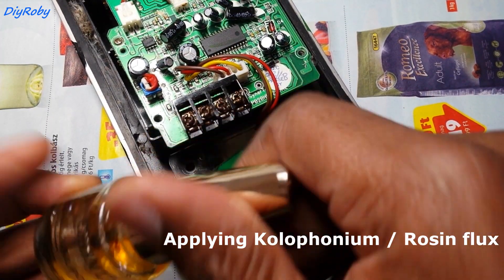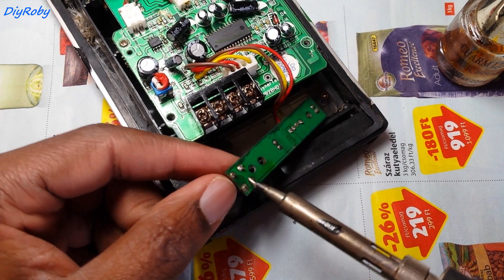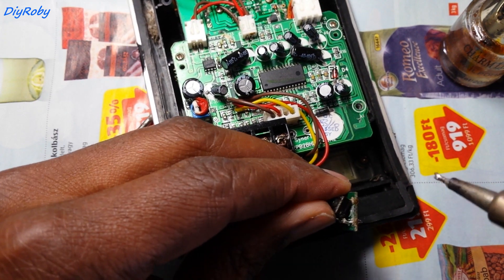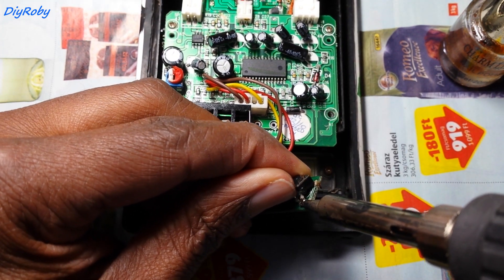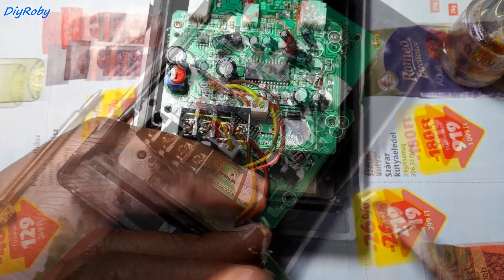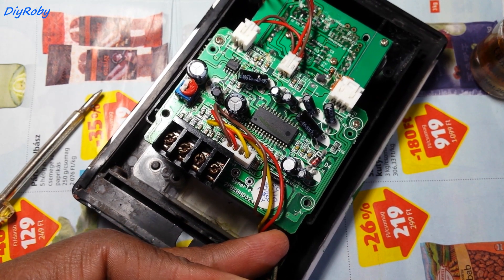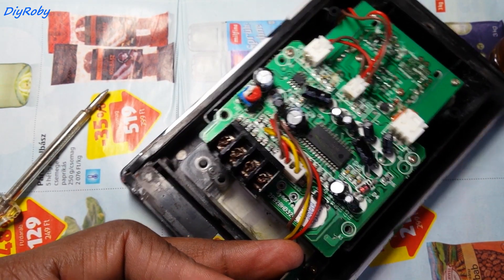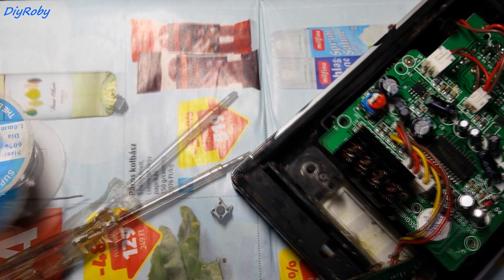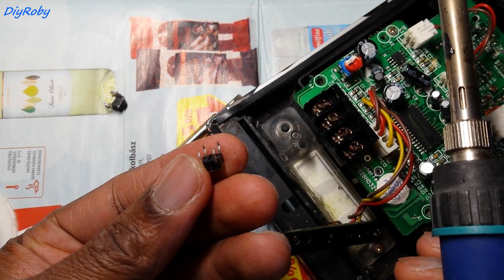This was a very long process since I only had my bag of tools at my in-laws' place. I didn't have everything I needed, but with the soldering iron I slowly got that button lifted out. All I did was heat the pins — the legs of the switch — hot enough to melt the solder holding the button onto the pad, then lifted it up. If I were at home I would have held the board in my vise and done this much quicker.